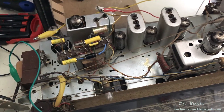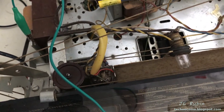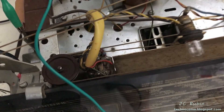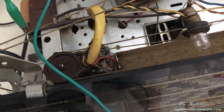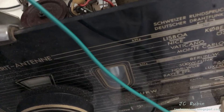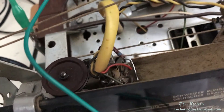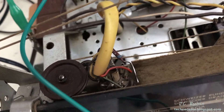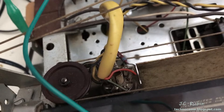We are going to stop for a moment and test all of these vacuum tubes. We haven't done any tube testing yet except for this magic eye, and I want to talk about this for a second. Getting the correct filament voltage as well as sufficient B-plus voltage to drive this tube — it seems a bit weak. I want to check my collection to see if I have another one to compare, but it just doesn't glow very bright, doesn't emanate very bright. That's something that needs to be addressed.